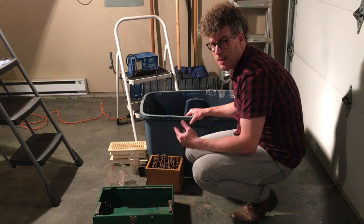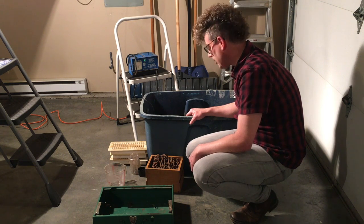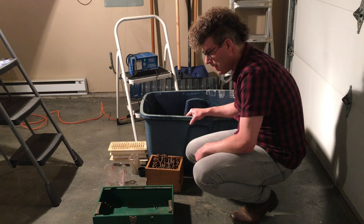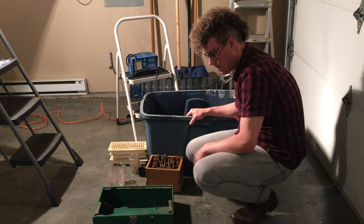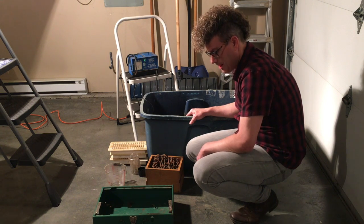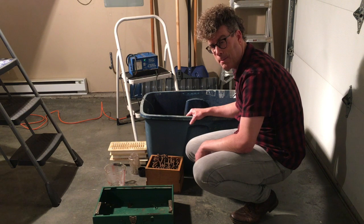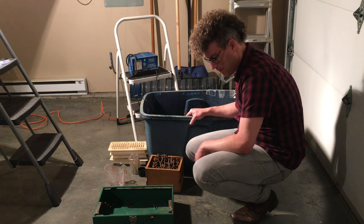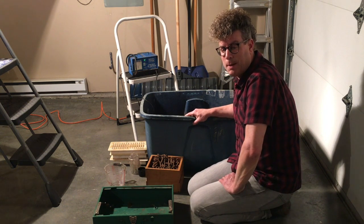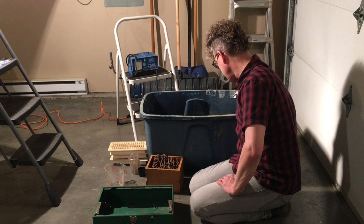This process should take about three or four hours for a stove grate — you could leave it in longer, it won't hurt. If you're stripping something like a stove body, I usually leave it in for 16 to 24 hours or so. Sometimes you take it out, hit it with a wire brush and the hose to get any paint off. The electrolysis works to remove paint — the bubbling action gets under there and loosens it. Sometimes it comes off in nice sheets; other times it just loosens it and you'll still have to scrub with a wire brush or scrape a bit. The solution usually lasts a few days, and when it stops bubbling or isn't working well, it's time to replenish or replace your electrolytic solution.